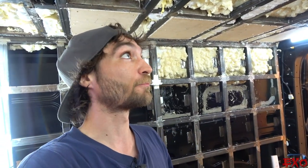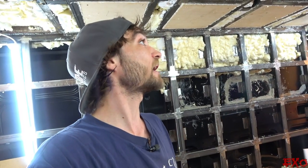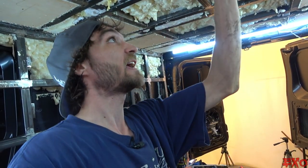I was kind of worried that there wouldn't be enough air for the foam to expand and harden, because that would really stink. You put up those squares with the foam on it beforehand, and then it doesn't fully cure, or you get those pockets of air where the foam doesn't expand. I wanted to avoid all that because you really do need to have good breathing room. So that's why I'm doing it this way, doing the foaming first and then cutting it flat and then using adhesive against that to use pressure against the roof and the steel cage. Nothing is gonna be moving.